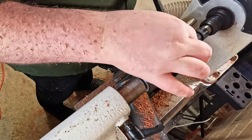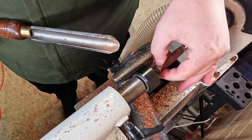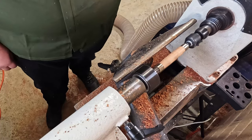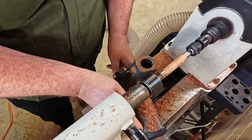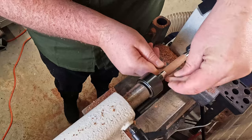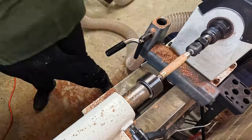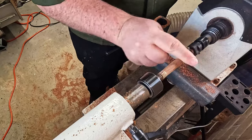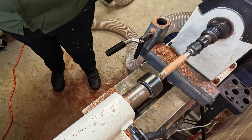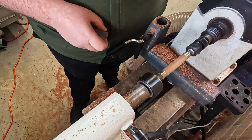You may have noticed at the start of this clip I actually switched tools, and now I'm already moving into the sanding. As you may remember, I do 150 through 600 and I go left to right in between to go along with the grain. It's a bit harder with the fiddleback because it sends the grain in all kinds of wild directions.